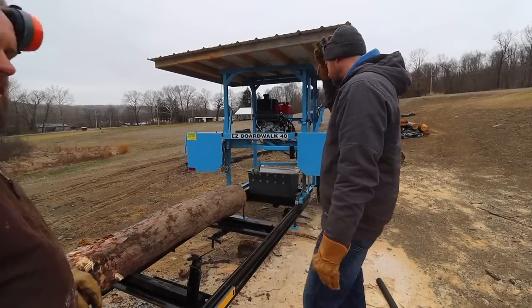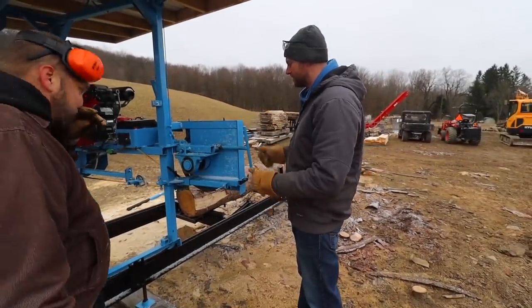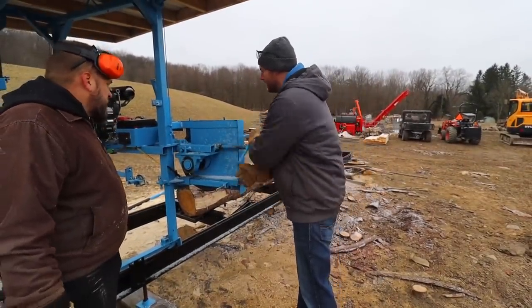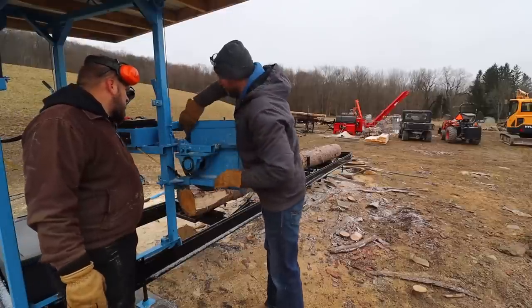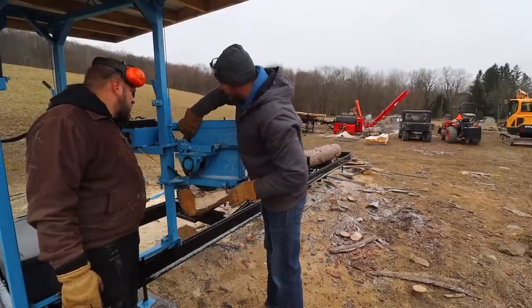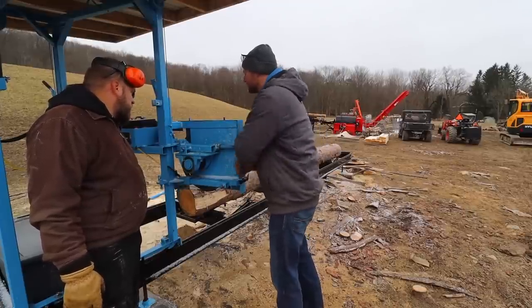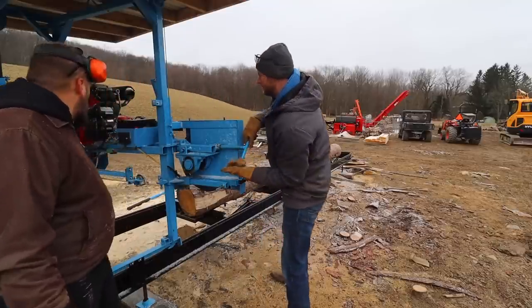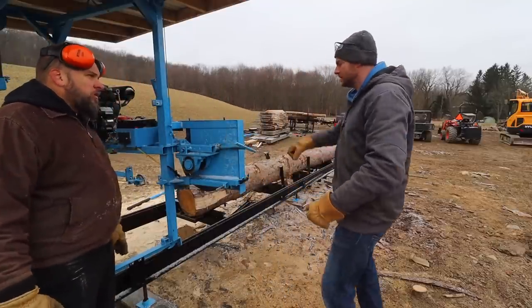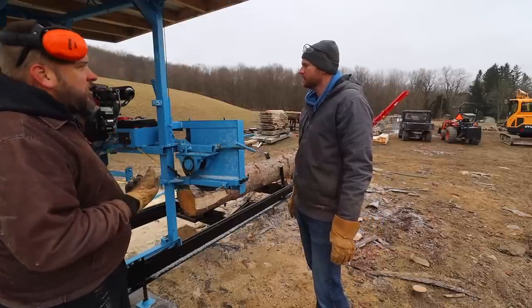Can you show me how you tension the blade? One thing I really like about this mill is you don't need any extra tools to tension the blade. On some mills you've got to have a ratchet and a torque wrench. On this one it's got a built-in T-handle, and you know you're at the right tension when this washer here is directly underneath that little stick — it's your guide for making sure the blade tensioner is correct. So you don't need a torque wrench or anything to measure your tension. Nice and simple.